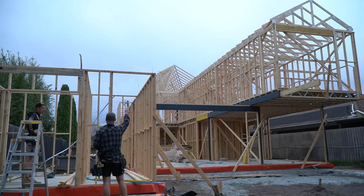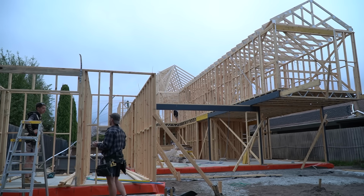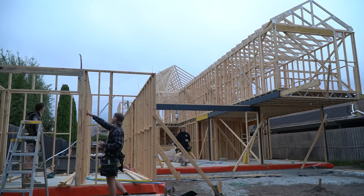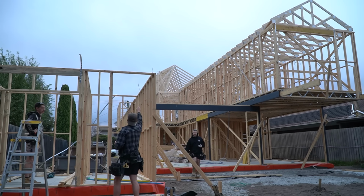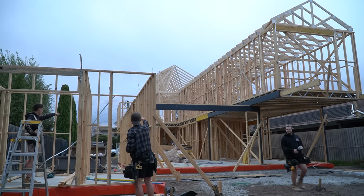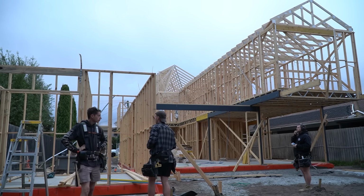And then what we'll do once those rafters are in, I believe this is a flat roof, I'll check it. I think it's 1 or 2 degrees. I'm gonna say 2 degrees, we'll double check it though. It changes pitch, but it's going to be 2 degrees from that wall point there, running back up to this wall. So they're not going to land in the same pitch. These rafter walls. That wall there, yes, this wall in the middle. I've worked it out to make it work without doing 2 nibbles, and I'll show you that in a sec.